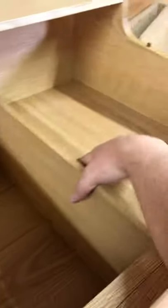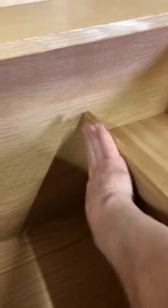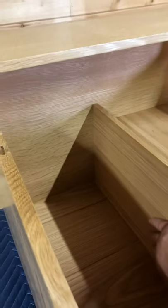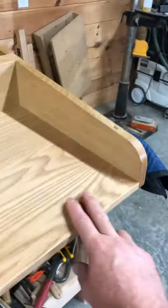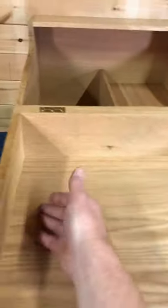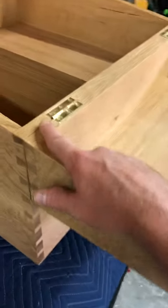I went ahead and went with plywood on the interior. I'm pretty certain that's probably what they did in the factory for the bottom panel. I'm not sure what they did on the originals, but I decided to dado these into the back panels, the side panel, and even the front panel. They may have doweled them, or maybe dadoed just the bottom and side and then glued and fit the length. I used tongue and groove there. And on the top, kind of the same way — I actually used tongue and groove on the side too. I decided to use some more traditional joinery on that.